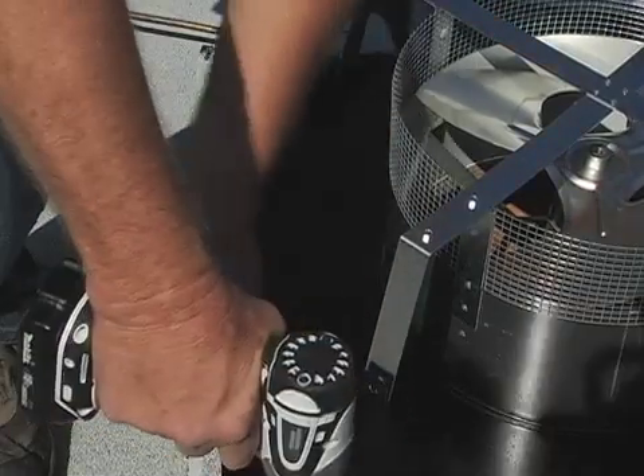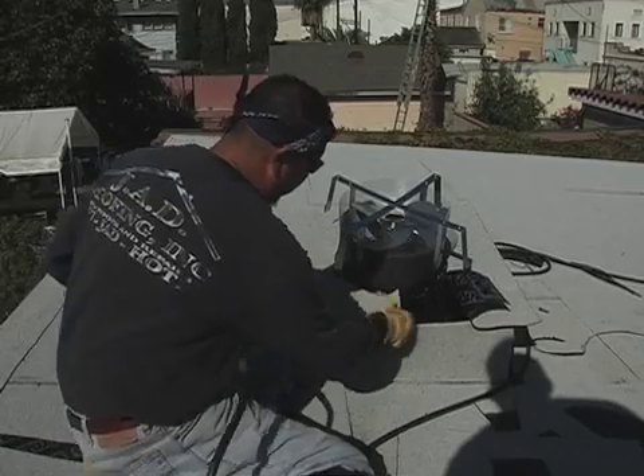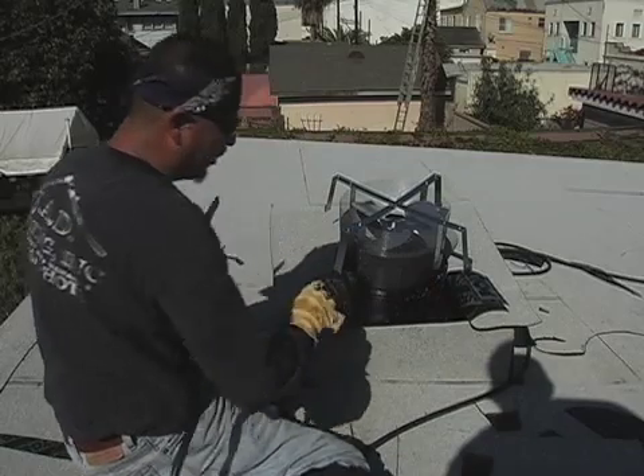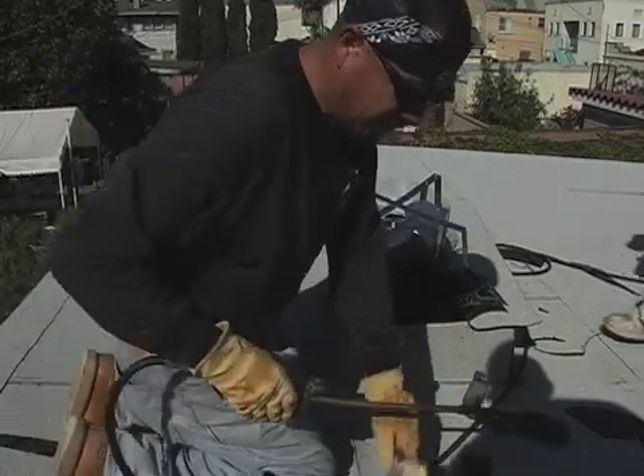Secure it down. Right here with the material joints in the middle — don't want to put a new piece in the middle, that way water does not drip in. You need zero mastic on this. Zero mastic on a modified torch. You've got to use a modified torch, or you've got to bleed some of the asphalt out of the material.